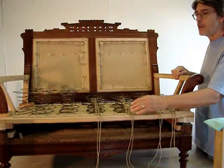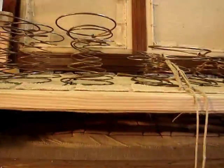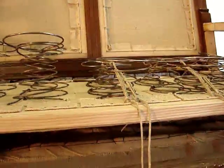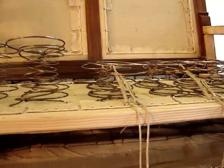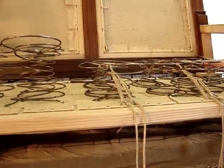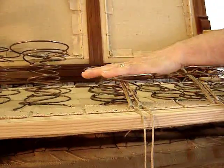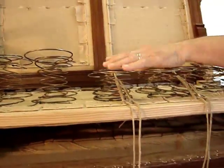In this segment we are showing the springs halfway tied in order to catch the elevations — the importance of catching the elevations being on a horizontal plane. Calculated into this spring tie is the amount of tension in the spring, how much the spring will flex as it is being compressed, and what its elevation will be once it is no longer compressed.